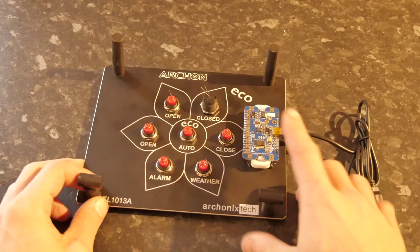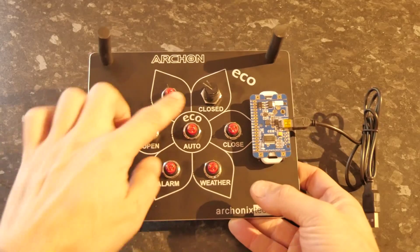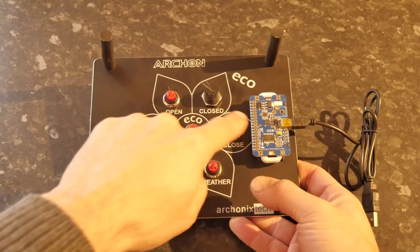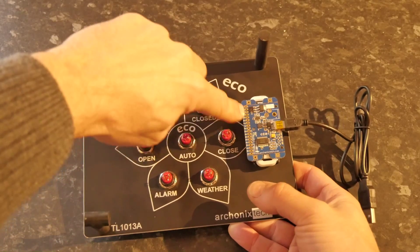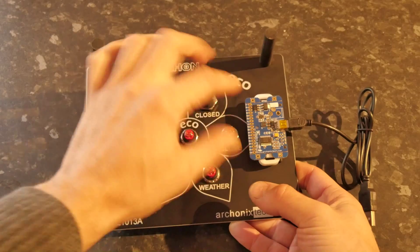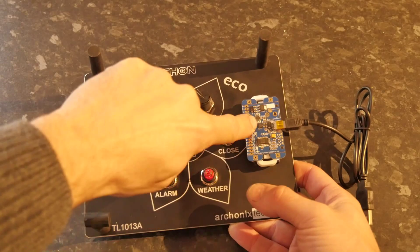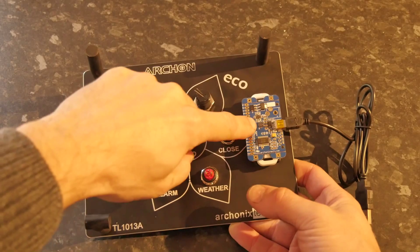So I fixed the push buttons to the panel, I've added an LED here. What I'm going to do now is put weak pull-up resistors on all the switches and wire them to the inputs on this — effectively an analog to digital converter. There's a PIC microchip here and an FTDI232R.